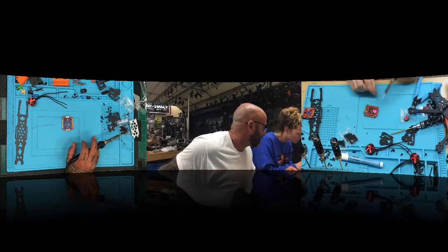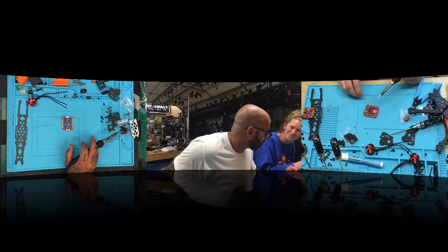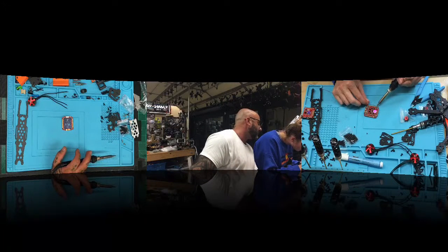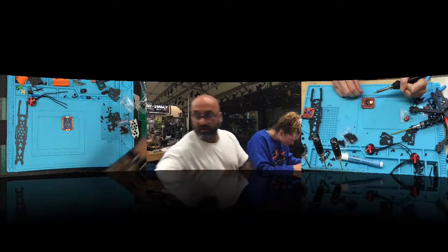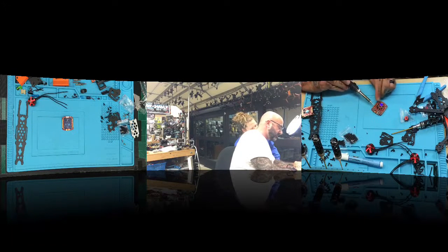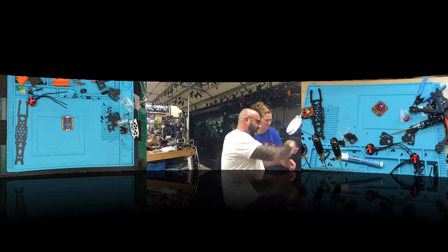Okay, it's going on now, so try it now. I don't know if you just didn't shake the flux on there or what, but try it. Why can't I get it to work? Use this side. Hey Sam, use the side. Come in flat on it and use the side. It's not touching. Let me see. Let me try this. See, I'm coming on the side. You want the flat part of the soldering iron, right? So this area, not the tip, because you're coming in like this and it's not making contact. Okay. So just come in flat, and then you've got to fix those ones over there.